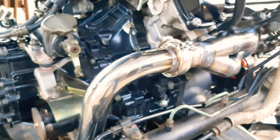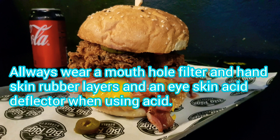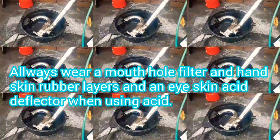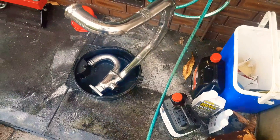V-band exhaust clamps to keep everything clean. And then what we do here is we're actually doing what we call passivation. The nitric acid removes the free iron from the surface layer of the stainless steel, leaving a chromium finish and preventing rust.